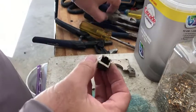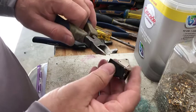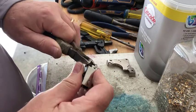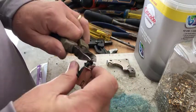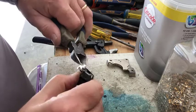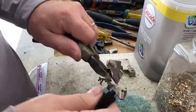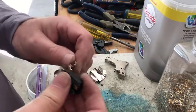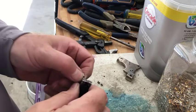With these you can see the gold-plated pins are inside, and what you've got to do is peel off this metal sheathing. Some of these come apart pretty easily, some of them want to be a pain, so you just have to mess around with it a little bit. This one is being a little bit difficult — just peel that back and get underneath there and peel it off of the plastic part. Always test your metal — this one is lightly magnetic, so that's going to be stainless steel. I've had regular tin, stainless, and brass, so you always want to test it.